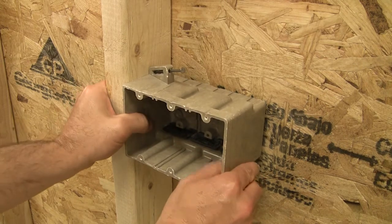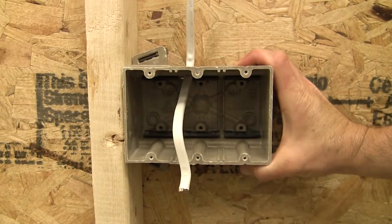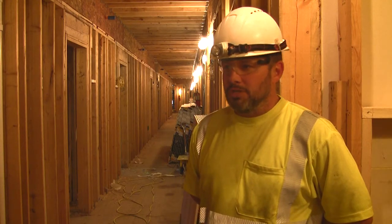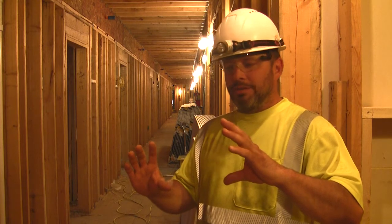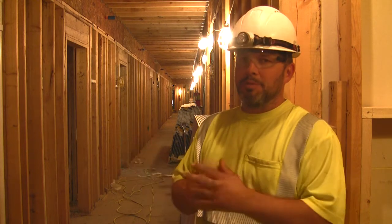Installation is important too, as we understand time is valuable. Fiberglass boxes are much more rigid than their thermoplastic counterpart and aid in a quick and reliable installation process. Two-gang, three-gang, four-gang switch boxes seem to be about the best in the market for being rigid. After the sheetrock goes up, there have been numerous times when competitor boxes are crooked — we spend about 25 minutes just trying to get it straight and acceptable. Whereas with the Allied box, we never have that problem.